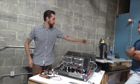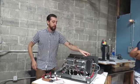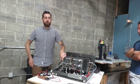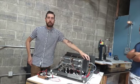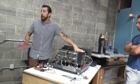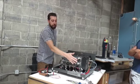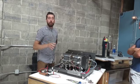Same with this. When that says, okay, I need hot water, this just turns on 24 volts to this. You need steam, turns on 24 volts to this. So as much as this is a computer, it's pretty much just a breakout box. This is physically where the power gets distributed to all of these components to just turn on and off.